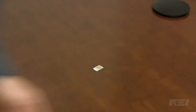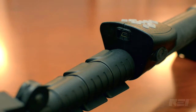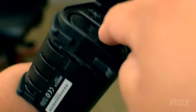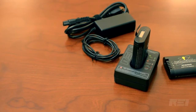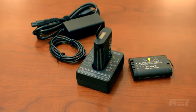The Orion 2.4 antenna head features an LED light for illuminating darker surfaces. The grip keypad includes a USB port for loading firmware updates. The Orion 2.4 comes with two lithium-ion rechargeable batteries with a typical runtime of 8 hours for each battery and a 2.5 hour recharging time. The battery can be charged in the unit or with the included external battery charger using 100 to 240 volt AC power.